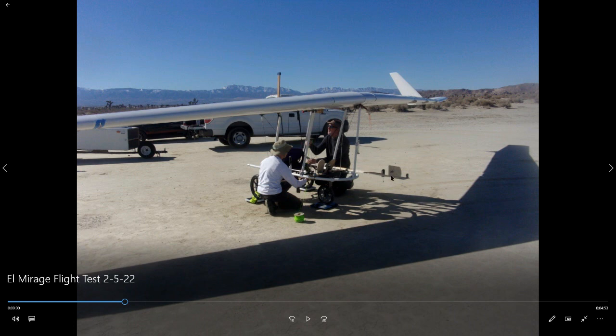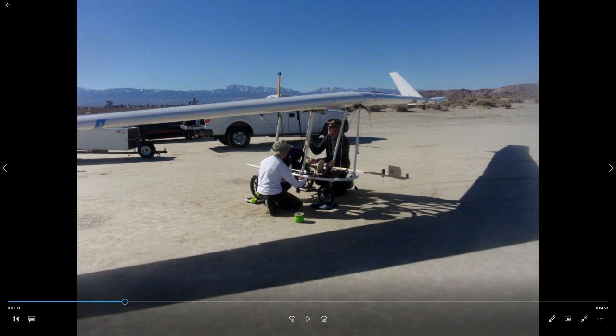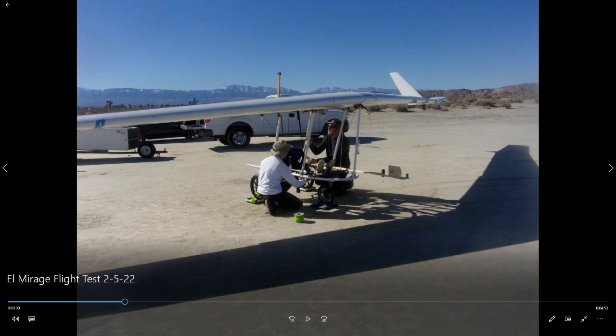Here you see a little bit clearer view of the air data boom. This is the angle of attack indicator. There's an anemometer here, and the camera sitting here to record the data. And I put on a standard set of rudder pedals to run the nose steering. Had a chance to diddle around with that and get the sensitivity set correctly, and by having regular pedals, there's no more confusion of having to use left stick and right foot and oddball things like that. It's just straightforward steering. Of course, I have to have the nose wheel steering because I don't have active yaw control.